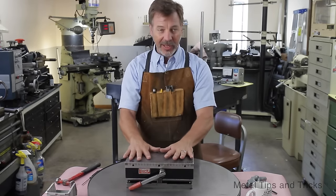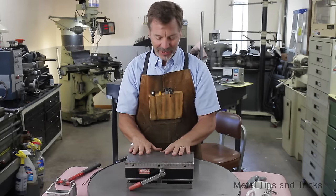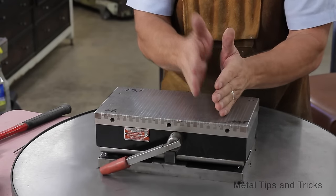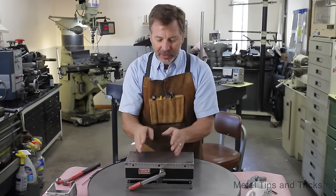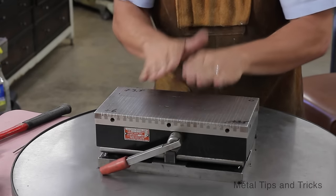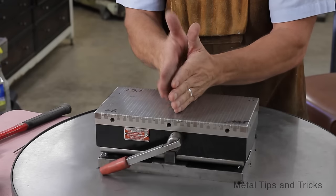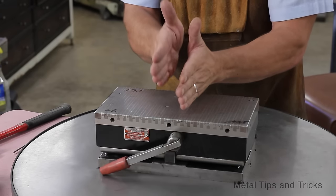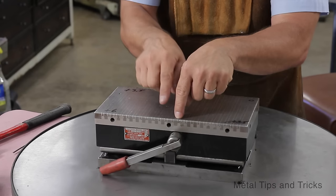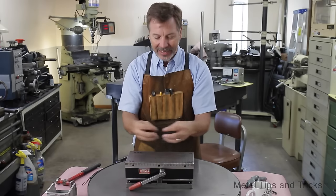A lot of you don't know how one of these works — it's kind of a black magic, and I'm not exactly sure myself, but I'll do my best to explain it. We have this top plate here, segregated by different metal plates, which allows the magnetic flux from the magnet to come up and grab your metal. The magnet below is similar — a ceramic magnet, an insulator, a ceramic magnet, and an insulator. The poles are actually reversed on them, so if it's negative on one side, the next one is positive — it goes back and forth, very similar to connecting batteries together.